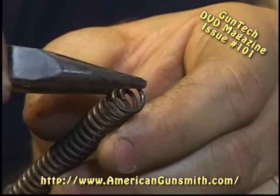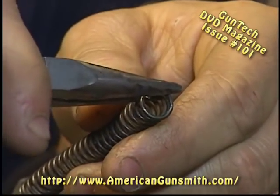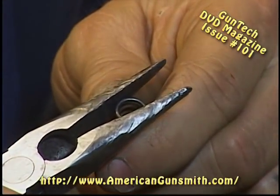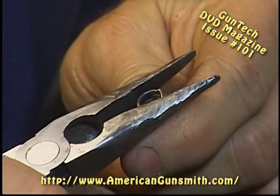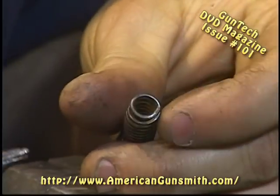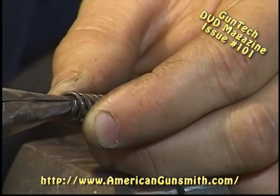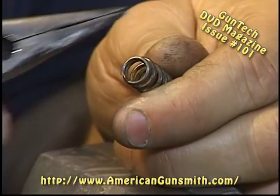Most of the time we can't enclose this, but sometimes you can pinch it down. That one's going to pinch down a little bit and stay a little closer — that helps. But most often, I like to enclose and pinch in this last coil. I just simply work it around, squeezing it lightly. So now you can see that that coil is tighter — it would fit onto a plunger tight and snug and hold it. Now, granted, if there's supposed to be a rod moving back and forth in that, you wouldn't want to do that. But that tightens it up.